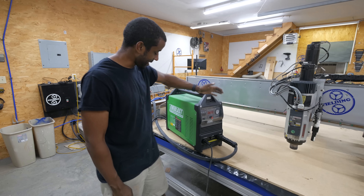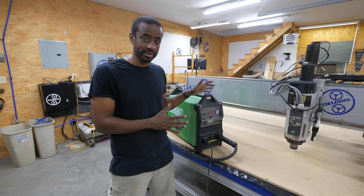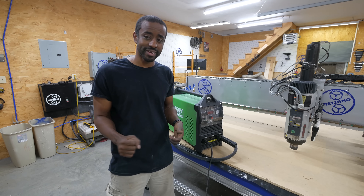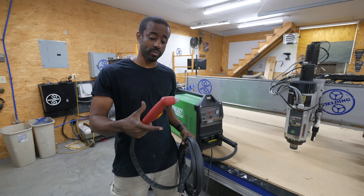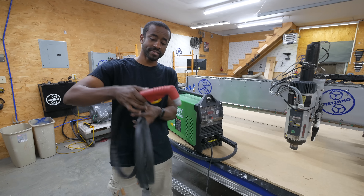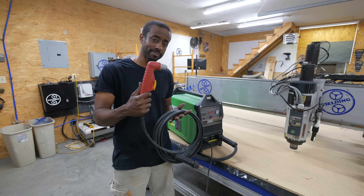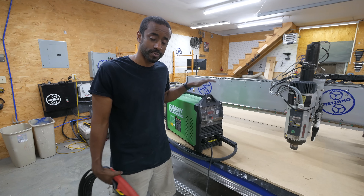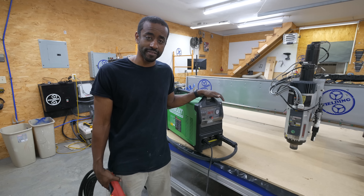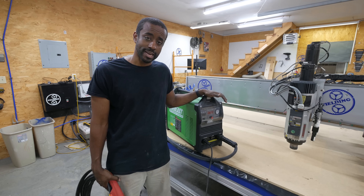Next up we have our plasma cutter — this is an Everlast plasma cutter. I've never actually used a plasma cutter before I started building this project, so when I bought it I had to read the instructions and teach myself. This is the torch head that came with the plasma cutter. I could have just zip-tied the trigger closed and moved the head around manually, but my machine is so large that the cable isn't nearly long enough, so I ordered a special cable they make specifically for CNC machines. The Everlast is one of the larger ones — you don't need one nearly as powerful as this; this will sever an inch-and-a-half plate, which is way more than I'll ever need.